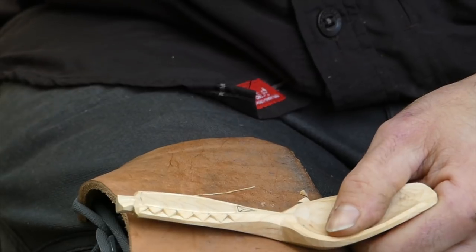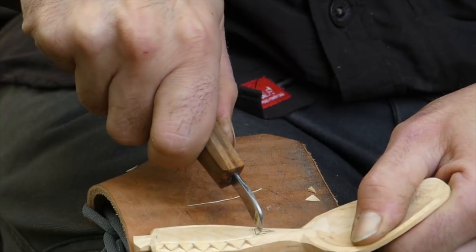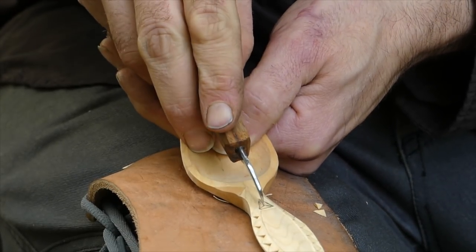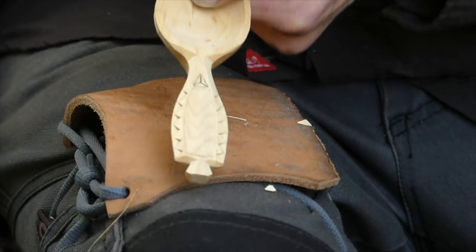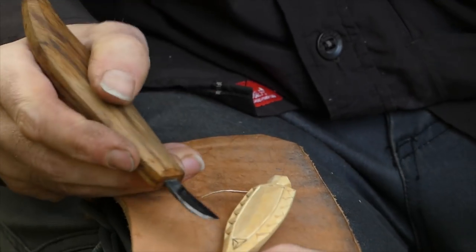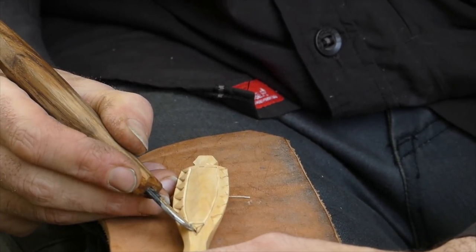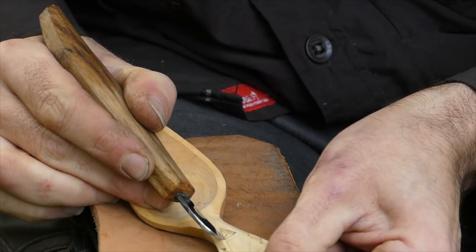And then we're going to go for a sheep's foot type blade again, and I'm going to push in to the middle so that I'm cutting deep into the centre of the triangle, but only just touching the edge on the outside. So hopefully you can see that I've just cut from the centre out towards the edge. Then what I'm going to do is push the knife in at the angle so it goes deep again towards the centre and lift out one little chip. Flip it round, push it in from the corner again,